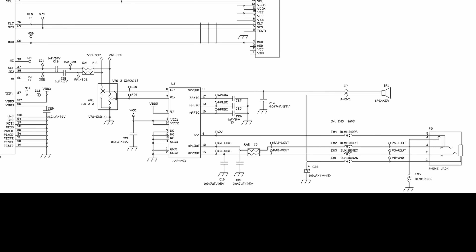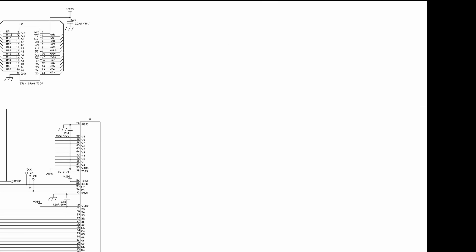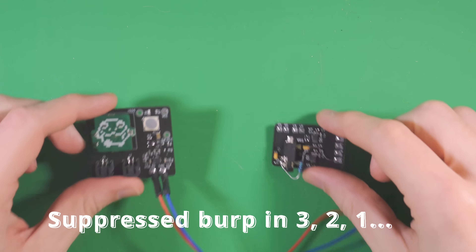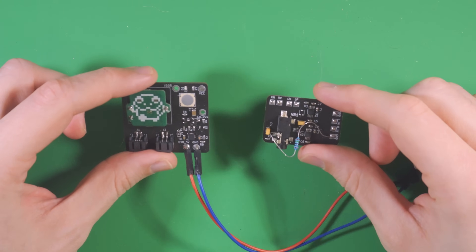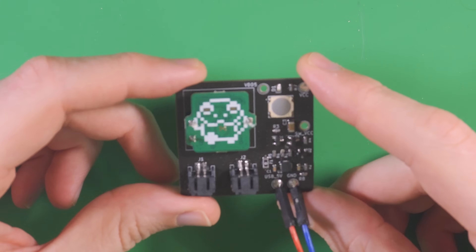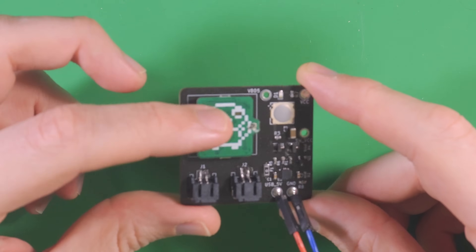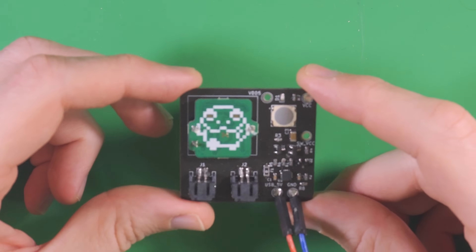Audio amplifier? Redesigning it. Get out of here. Power and battery LED? Frogulator says get the f*** out of here. That leaves me with the bare minimum circuitry to use as a starting point. Because the power and audio circuitry are the most complicated new pieces of this schematic, I de-risked the project a bit by designing discrete prototype boards for both. For the power circuit, I was able to leverage my existing work on the Frogulator and reuse the circuits for the 5V rail and battery indicator. To make the prototype easy to build, I just added a footprint for the Frogulator.